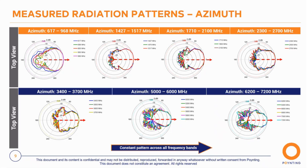We could have achieved higher gain to narrow the patterns further, but we believe 10 to 12 dBi is the sweet spot for a directional antenna. If you go too high, the beamwidth on both elevation and azimuth becomes too narrow, and any slight environmental adjustment — wind, vibration — will negatively impact antenna performance and result in intermittent connectivity. With 10 to 11 dBi gain, you have broad enough beamwidth to be durable against whatever the outside throws at it.